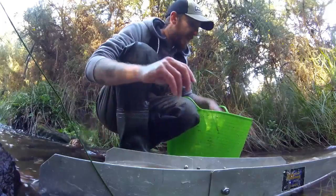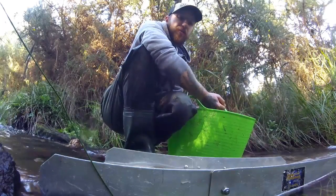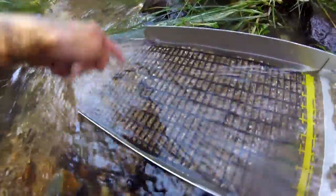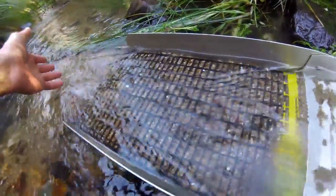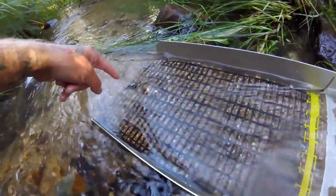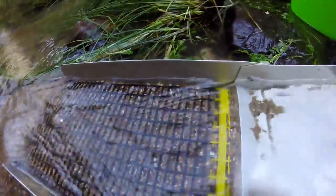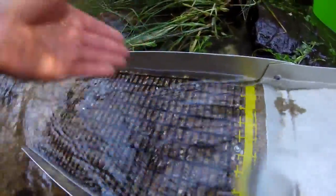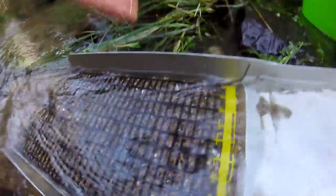It's all right doing a mini run with your hands, but otherwise you really want a little spade or something to feed it. Try not to overload it — one handful every couple of seconds is more than enough. We've finished our bucket and we're just letting this last little bit clear. When you do a large run, like 100 litres or more, you'll often see gold starting to accumulate up in the top parts of the riffles. If you're finding gold down the end of the mat, either you've got so much it's filled all the way, or you've got too much pressure washing it out. Realistically, do test with your mat — wash out half first, then the other half, and see what difference there is in gold collection.